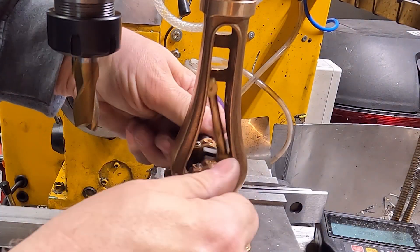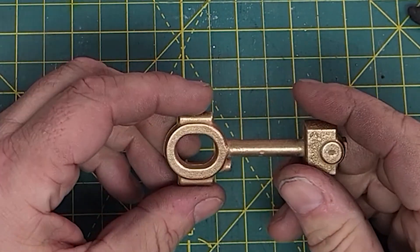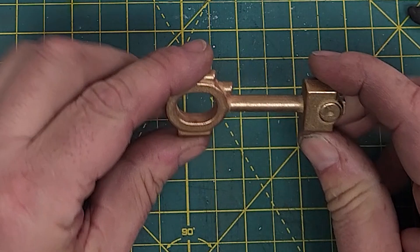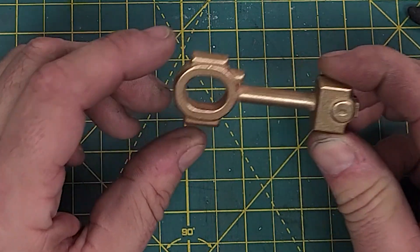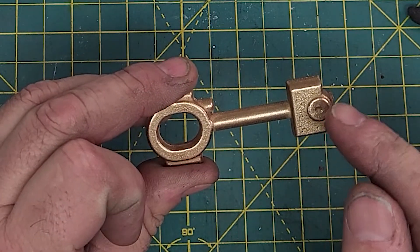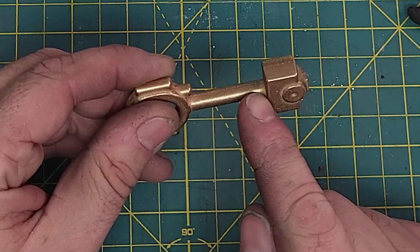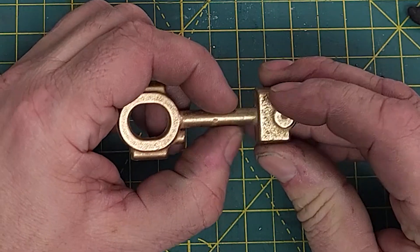When fitted to the machine it rotates quite freely. On to the crosshead, which is connected to the eccentric casting. The first thing to decide is: do I cut this apart and machine it separately, or do I use the eccentric casting as a fixture to start machining the other part? I'm going to put the eccentric in the four-jaw chuck and turn down the shaft in between until it is nice and cylindrical — it's very slightly off.